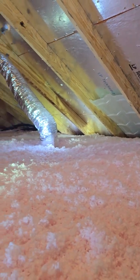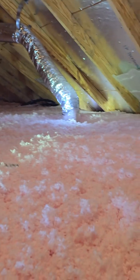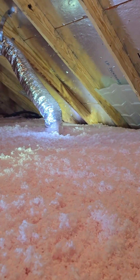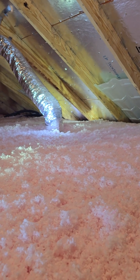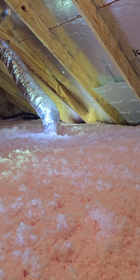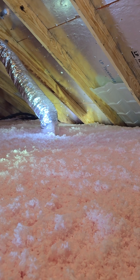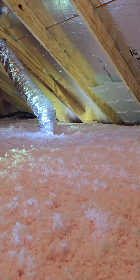That one's not seated all the way down right, and going all the way around maybe they have 10 or so — definitely not enough. What happens is for the areas that don't have baffles, in strong storms, the insulation is going to blow around. Either it's going to taper off and push away so you get areas that are uninsulated at the edges of the rooms, or it's going to go into the soffit area and just completely block it off.